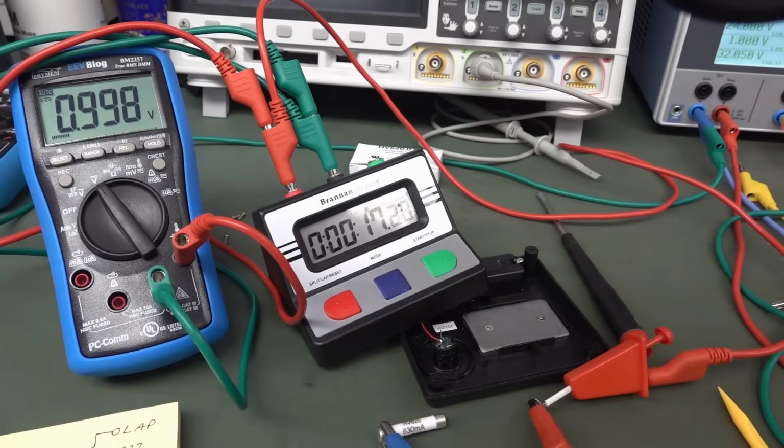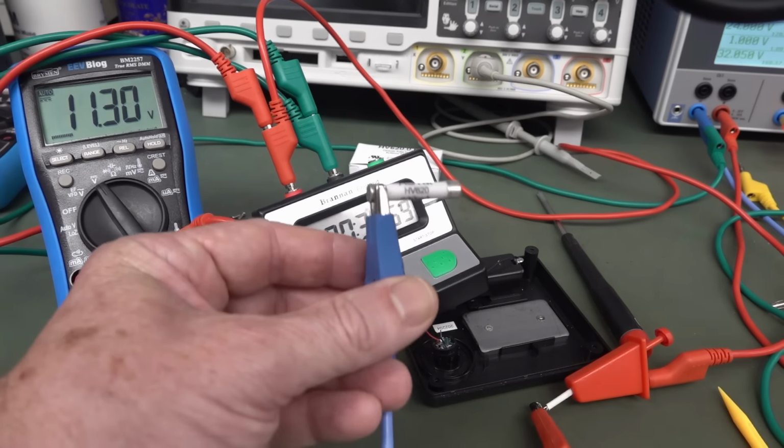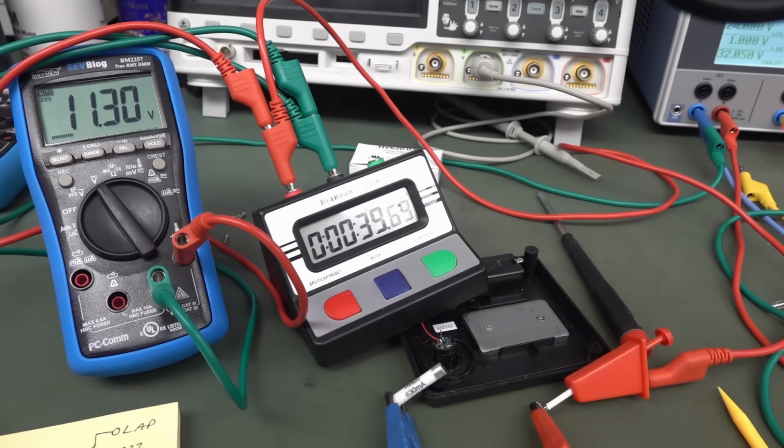So we've disconnected our fuse here. Let's start at 1 volt and let's wind up the wick, shall we? And where will it trigger? Place your bets, place your bets. 9 volts, maybe. 9.5. Getting there. Whoa, 9.6. Oh, there you go, 9.6 volts. No worries, so that is perfect. So we can tolerate a massive 9.6 volt burden voltage on here without this thing triggering at all. So that's exactly what I want.